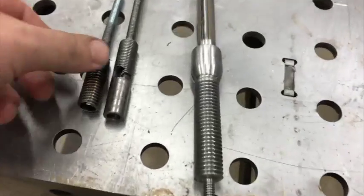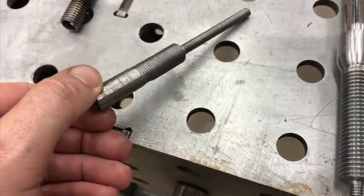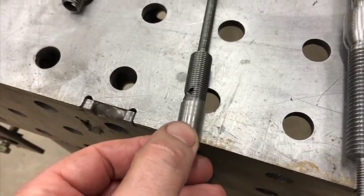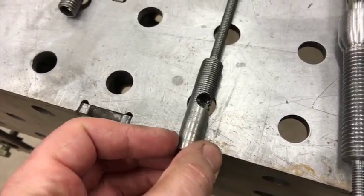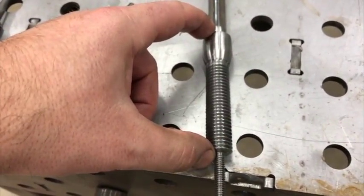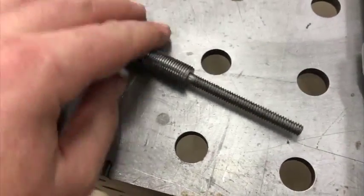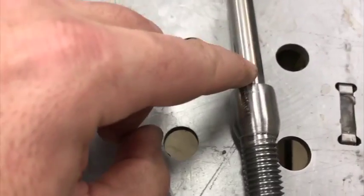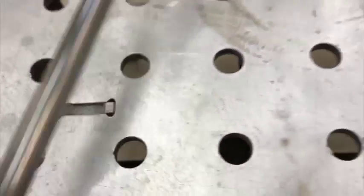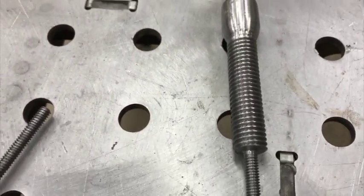All right, well, the piece I was working on when you last saw me was this piece. You saw me putting that hole in there. And I guess I had it not quite centered and those threads were really thin. So yeah, that didn't go well. One thing he said was that this section here could be any size that we wanted it to be. Because this was a half inch here and this is a half inch, when you cut the threads into it, it's just super thin.